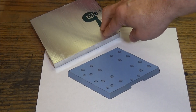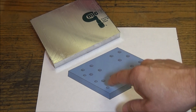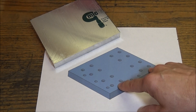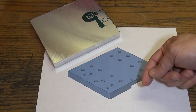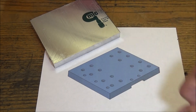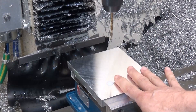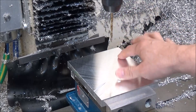Let's go over to the Precision Matthews and we'll machine this out. It's not very difficult — we're just going to be drilling some holes, boring some counter sinks, then we're going to rotate it over and put a slot in the center for our air cylinder clearance. I've got my Mic 6 stock in the mill here and we're just going to start the program — we're going to be drilling some holes.